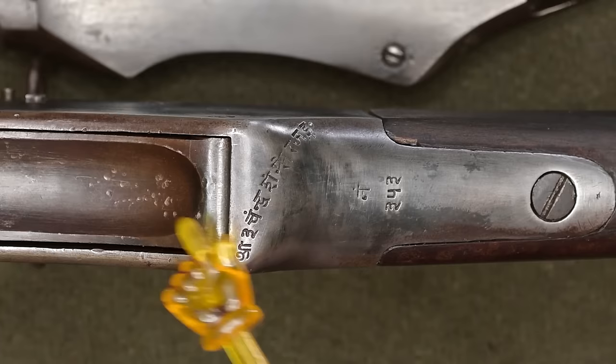a narrow neck. The breech blocks are also often improperly fit. You know what, I might need to show you what I mean by that. We have our breech block and our receiver. The receiver has a round cavity, and the breech block acts like the inside of a hinge. It has a round backing. They're supposed to mate perfectly at the rear.